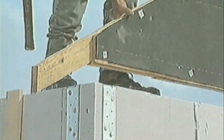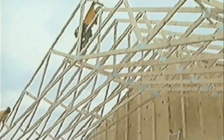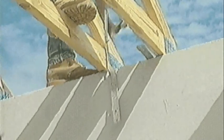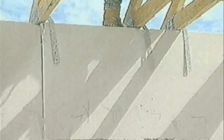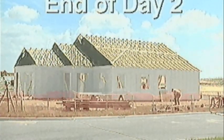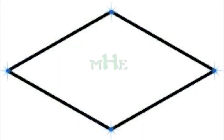ETONG advantages stretch beyond saving on labor costs and time at the construction site. The roof trusses are set and attached with ETONG-approved tube nails to the value panels. Standard common nails are used to attach the anchors to the trusses. Because the value panels and connections are exposed to view, the building inspection can occur after the building shell is completed. Including truss installation, building this ETONG value panel home has taken a 3-man team 2 days.